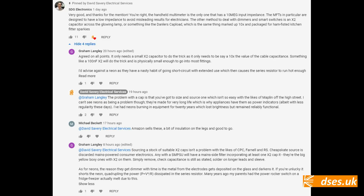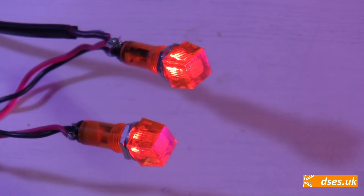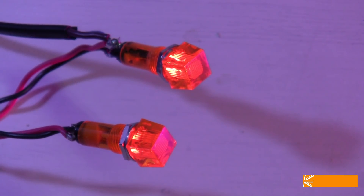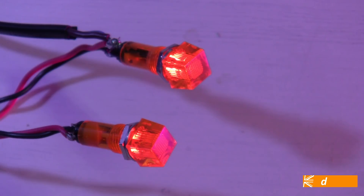Graham also raised the concern that a failing neon can be messy. Neons get darker over time due to metal from the electrodes becoming deposited on the glass — I can demonstrate this with two neons bought from Maplin in the early 1990s. One was used on a project with constant illumination for over 10 years and is clearly dimmer than the one with less use. Graham says that in a worst case, metal deposits can short and cause the series resistor within the assembly to overheat with potentially scary results.